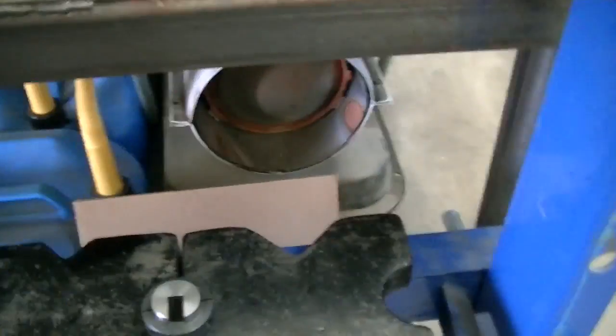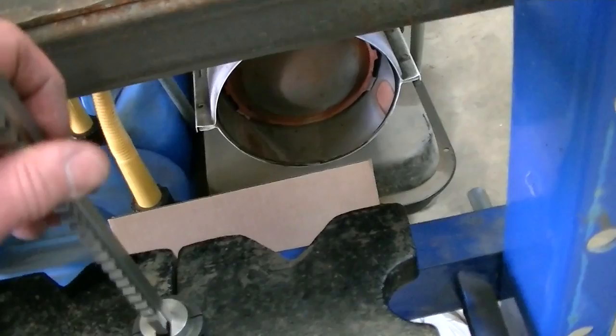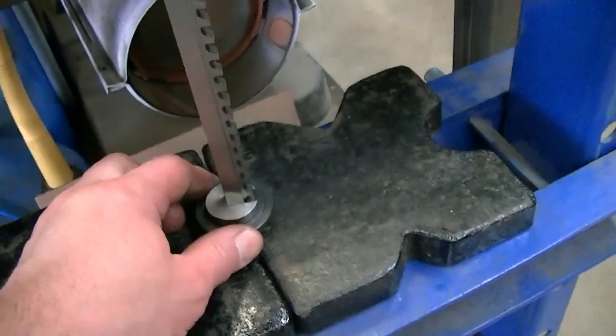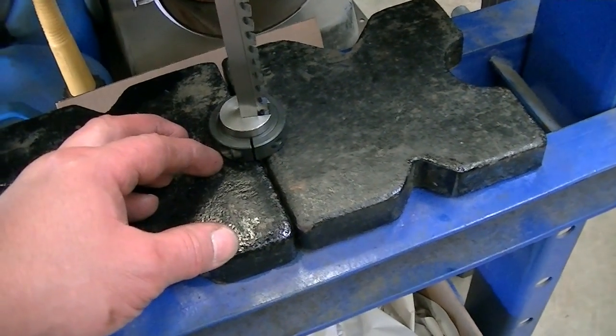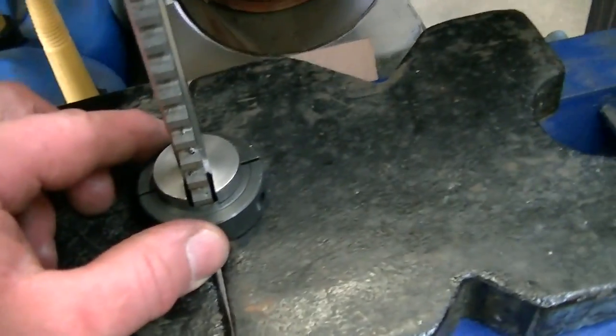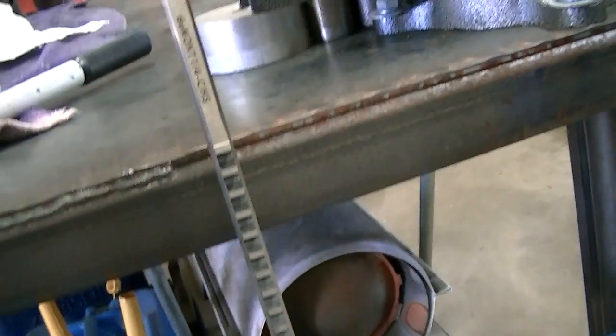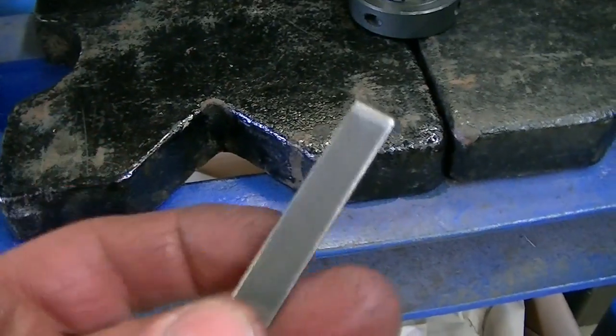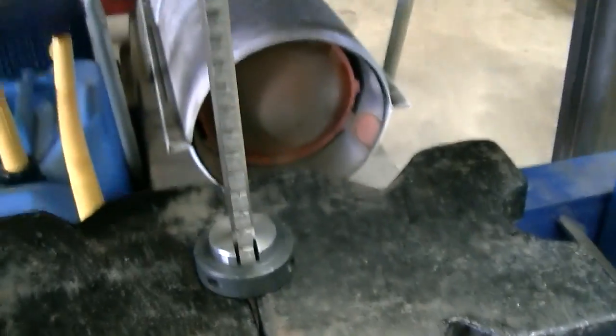I have to lift that up a little bit and then drop this down into the slot, and get it turned the right way first. If you don't know how a keyway broach works, each one of these teeth is just a little bit larger than the one before it. You can see the chips down in the box there — it basically chips away until it makes a keyway. I got this padded box down here because once I hit the end, the broach pretty much shoots right out the bottom and they're hard and you can break them, so you want some sort of padding. I got this box from something off eBay with a bunch of wadded-up paper in it. You do one full pass, then after that you put in a little shim, do one more full pass, and then you have your full-size keyway.